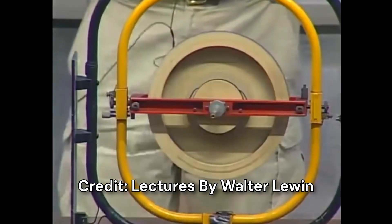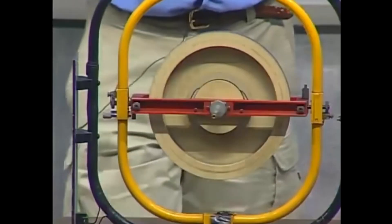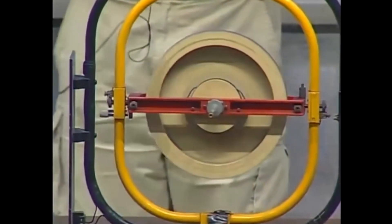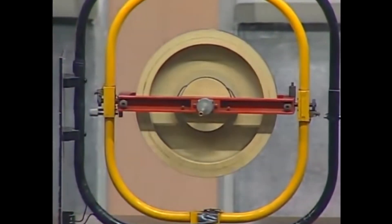There are shaft encoders in the mounting frame — in the three-axis gimbal. So if a vessel or an airplane changes its heading, the rotational axis of the spinning disc remains the same, but the mounting gimbal will have a shaft encoder which can sense how much the heading has changed. And that's the way a gyro compass works.